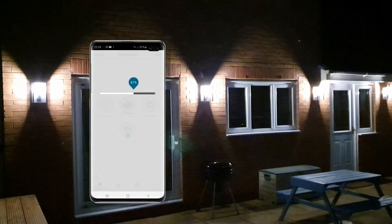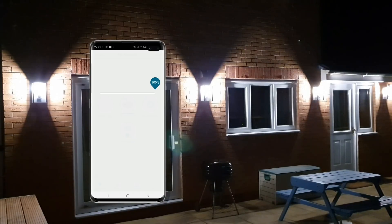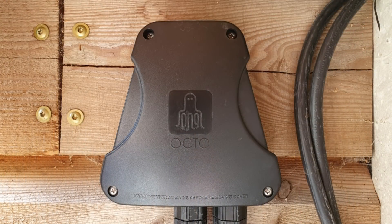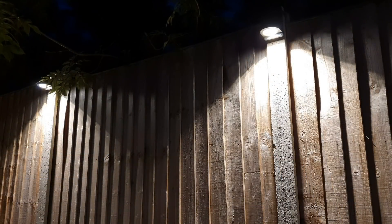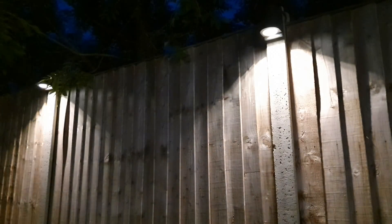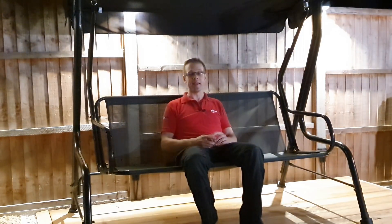Nowhere in an electrical installation is the light level more changeable or more affected by external factors than outside lighting. As the evening light gradually fades, we can now adjust the light level accordingly, instead of having lights just blasting out at full level or not on at all. And yet how often do we think about dimming our outside lighting? I think that's an absolute game changer. The Dugas and Garda fittings themselves aren't smart — it's the Octo Controllers doing the work. I've selected compatible LED lamps to go in these, and now all my garden lighting is dimmable. I've also hooked up the PIRs to the relevant lights: the PIR at the front brings on the Garda fittings around the tree, and the one at the back picks up when I come out of the back door. I can also override the lighting using the exterior switch by the decking and the internal switch by the back door.